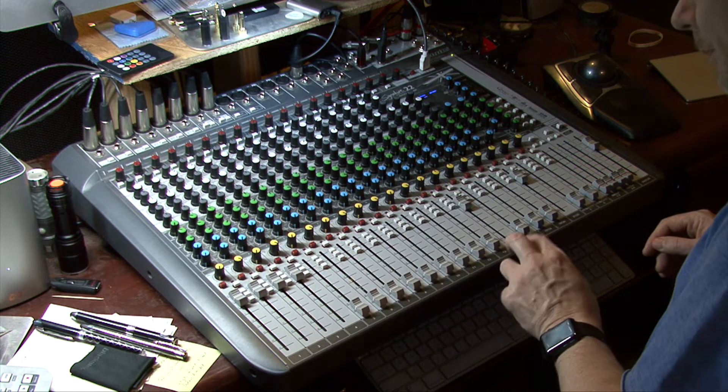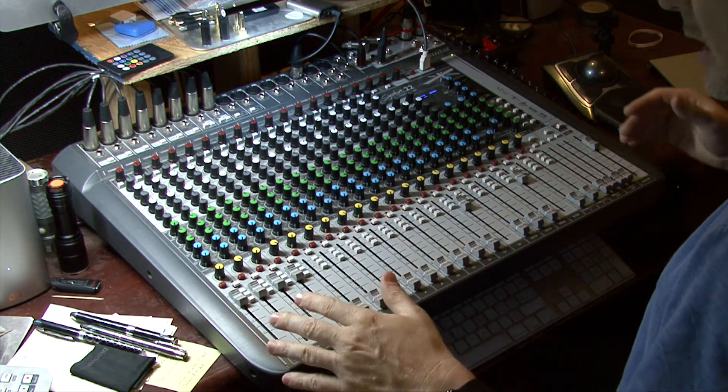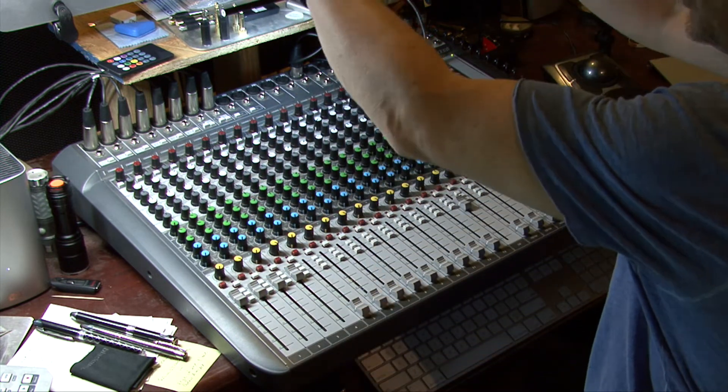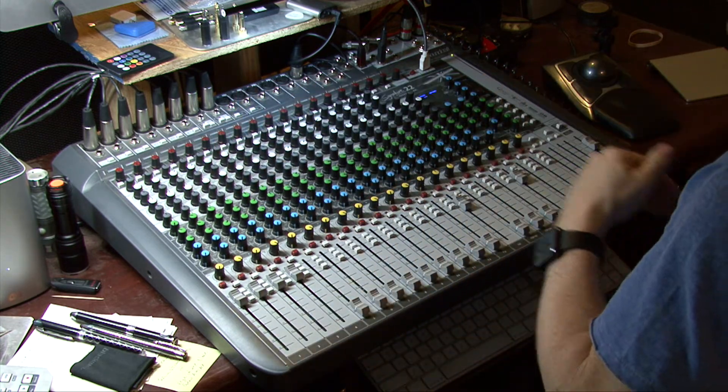The whole point is I'm going to do this for each stereo pair, panned left and right, so when I run my mix through this board I won't have to move faders here. I'll be able to set the faders from my session and run through knowing the level in the session will be properly represented on the console. I can then do EQ and mix moves without fader automation, building everything in the session and using the console only for its analog depth, warmth, and summing.